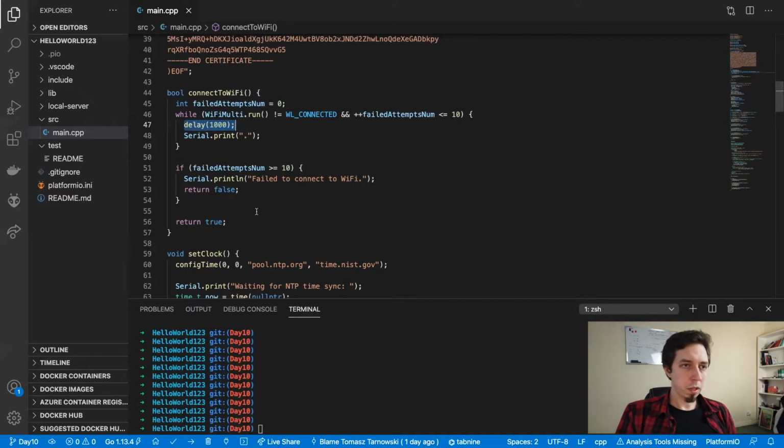Okay, so that's the goal: making all of this asynchronous, so we can press the button and in the meantime the Wi-Fi connects. If it connects, then we want to send the request. If it doesn't connect, we don't want to send the request. We just want the buzzer. So the buzzer is like a fallback mechanism. The buzzer is always going to work, but sending the HTTP request over Wi-Fi might work, might not work.